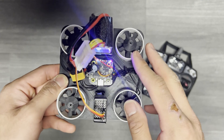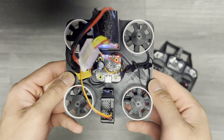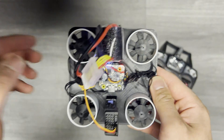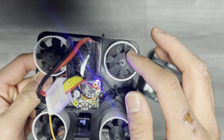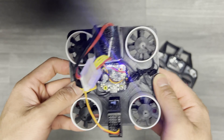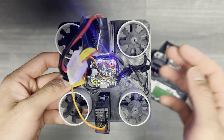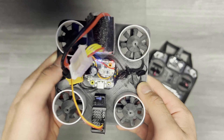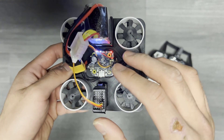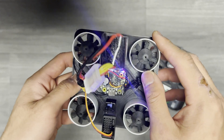In terms of what I need to improve, obviously it needs everything. Firstly, I think this design needs a full remodel — both the frame itself and the orientation of the ducts. Since the quad motors are pretty fat, the fan swept area of my EDFs here is actually extremely small, only about 660 square millimeters each. Extending these ducts to a 50 millimeter EDF would be a great start, though it would depend on whether the motors could handle that loading. The battery alone accounts for two-thirds of the total mass of this quad, so I'd either want to downsize the battery or increase the body size with larger EDFs.